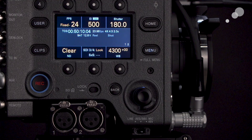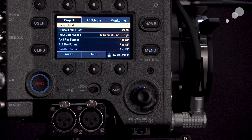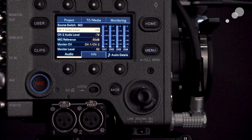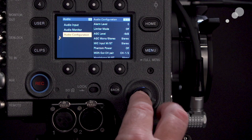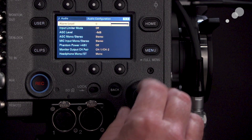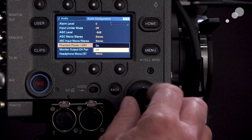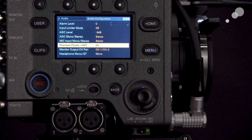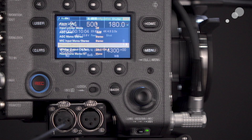We're in our default menu here. Let's go in and turn on Phantom 48 power. Press menu — this is the default screen. Select your audio option and then go in and select audio details. Click on that and then use the encoder knob here. Click in on the audio configuration menu and roll down to where it says Phantom power plus 48 volt. Notice that it's turned off, so let's open that up and turn it on. When I do so, notice that my green diode has now come alive. That's now going to provide us power to a Phantom 48 microphone.